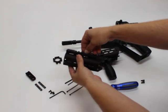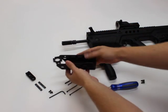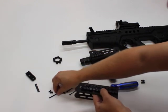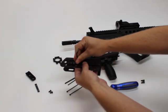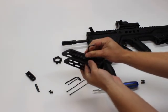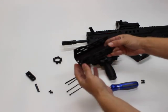You can see the lugs — the lugs fit into the slots like so. You can see the screw here coming through the back. What you'll do is put two screws through like so, and then your backer bar will thread on. We include all the necessary hardware and tools to install that — so we have our wrench here that comes in the rail kit, it'll be bagged with those rails. You just screw it on here and here until they're fairly snug. Give it a good turn. Now you can see the rail's on there, it's not coming off, the backer bar is on the back, and it's completely installed.